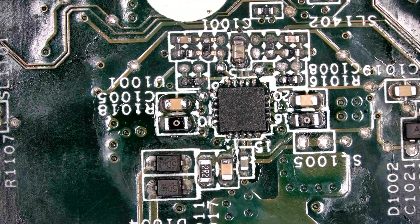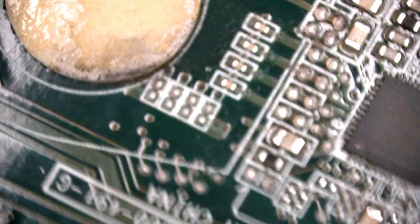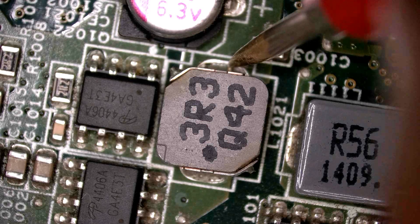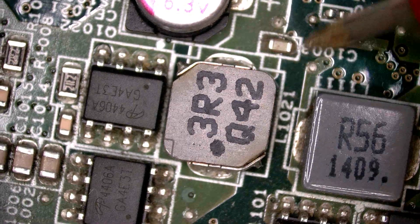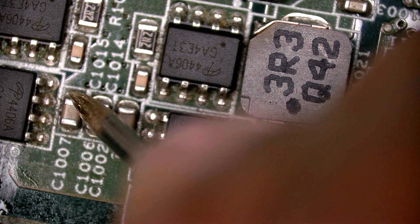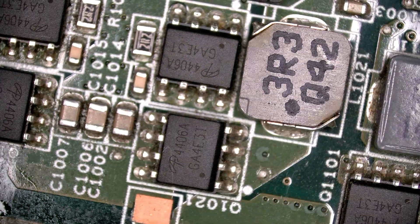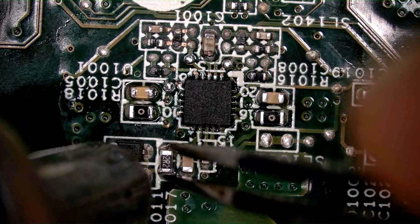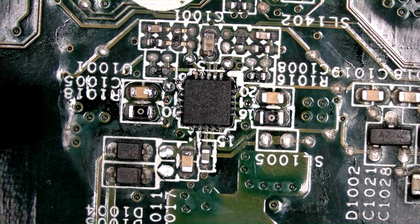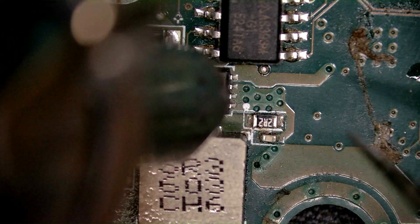Let's give the power — not responding here. Checking this voltage: there is no voltage available. 19 volts is present on input. This one is ground — no voltage here. Here also 19 volts present, but there is no output voltage. After that I found this resistor is open. When I first measured it, it was good, but when I replaced the IC and cleaned the circuit, I suddenly saw that the input voltage is not available to this IC. I found that this 2.2 ohm resistor is open.